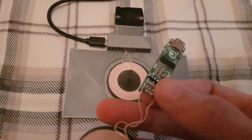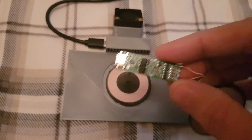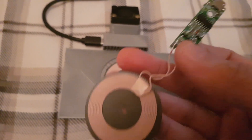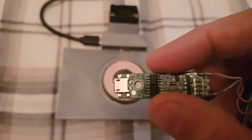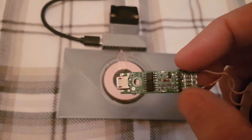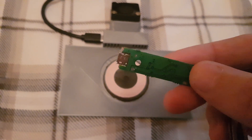This is the wireless charging module we're using. You can get five of them for around about six pounds — they're pretty good. These are rated for 15 watts, though I'm not sure they're actually pulling 15 watts. The downside is they do get pretty hot. You've got these driver chips here, and these smaller ones — they're either MOSFETs or transistors — and these three tend to get pretty toasty, and so does the board.